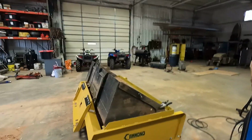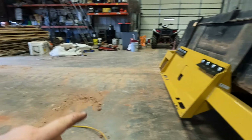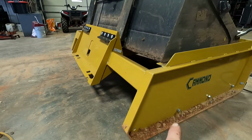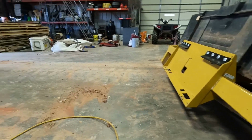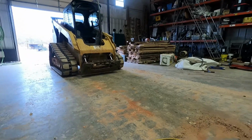One thing I don't like about it already is this plate is way too tall. So when you got it on the machine and you put it down, the top of that bar to the door is up about 4 to 6 inches. So if you just have to get out to move something, you can power it down and climb in and out, but if you let it sit probably more than 20 minutes, it'll bleed off and then you won't be able to get the door open. So you have to unhook from it to leave it.